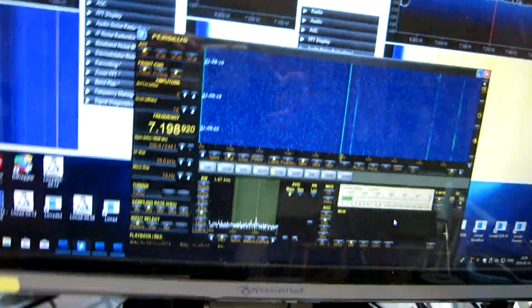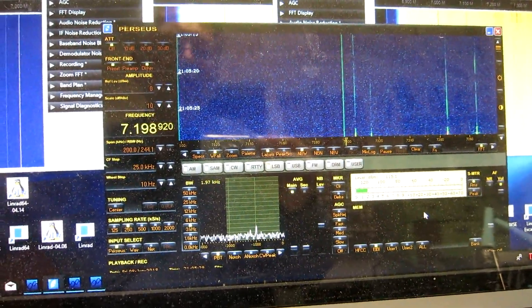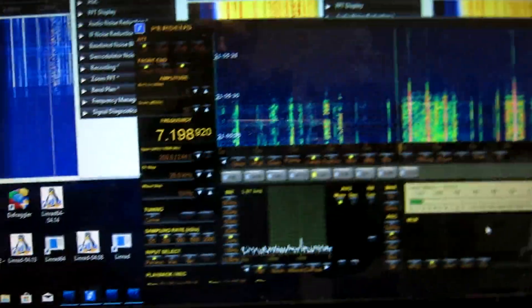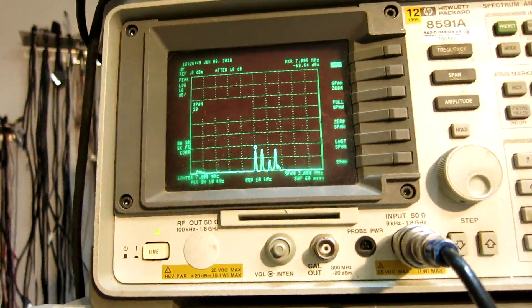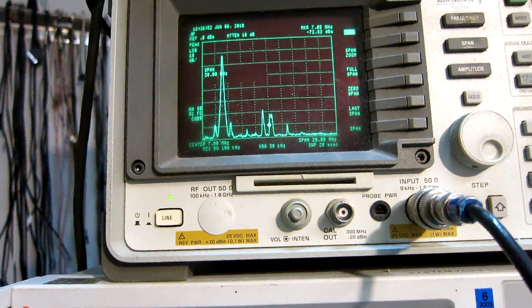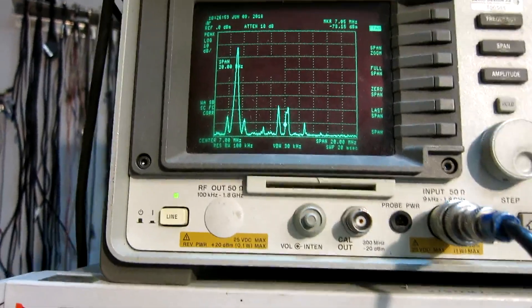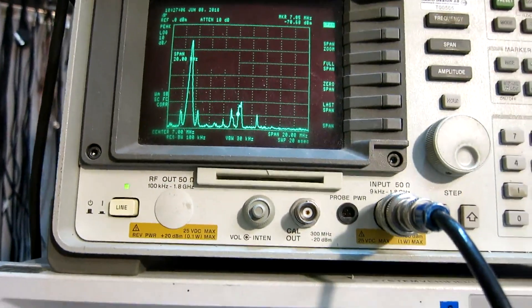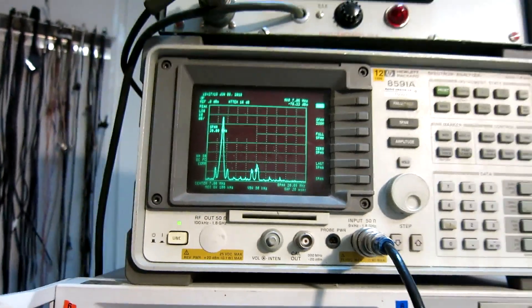Now since this is digital feedback, it will disappear if I add an antenna signal. So I turn on something from the antenna, and this is enough to make that disappear. Looking at the spectrum analyzer span of 20 megahertz, the test signals are a little weaker than the antenna signals. So this isn't a problem — this is not third order intermodulation.